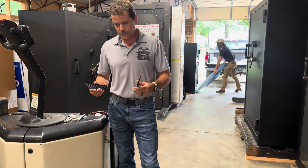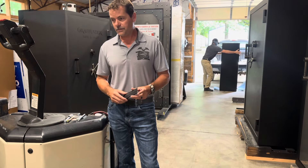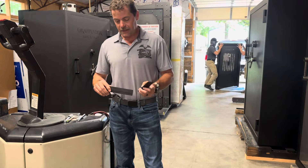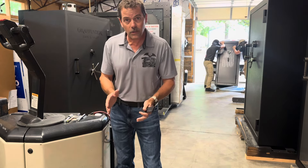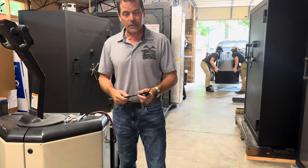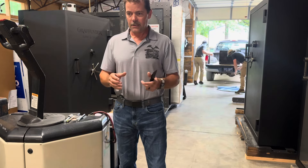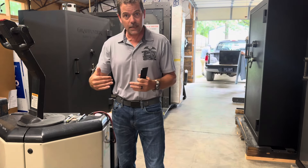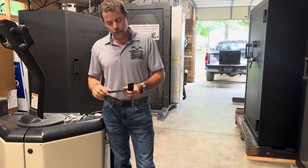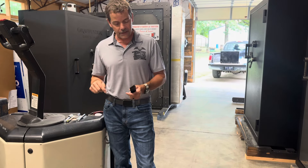Everybody says, 'They're so heavy, how would they ever do that?' I have heard of instances where they do. The question that always comes up is: will anchoring hurt my concrete floor? Generally no. There are some exceptions, like post-tension slabs where cables run through them — if you're built on a hillside, for example — but in general we're in pretty good shape and can just run four holes down through the safe.